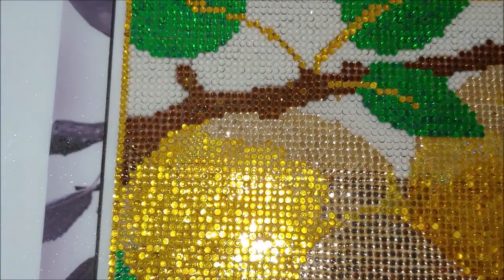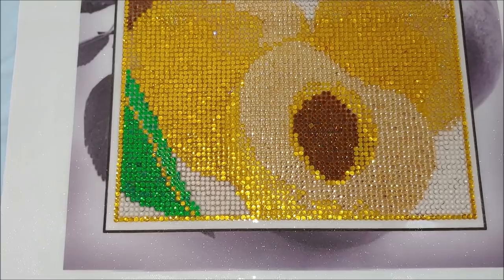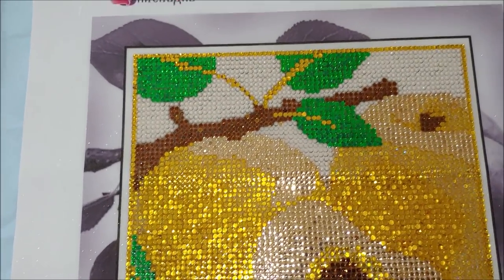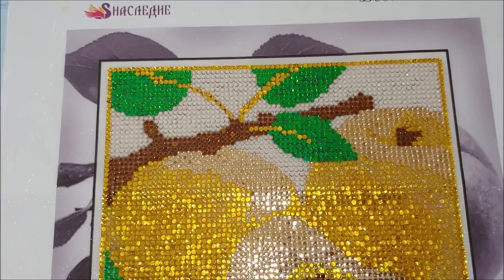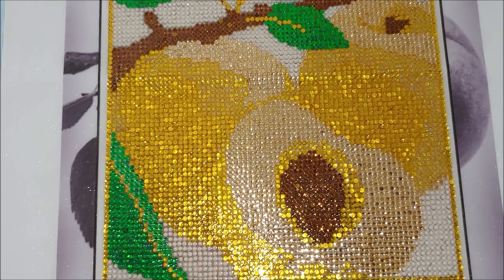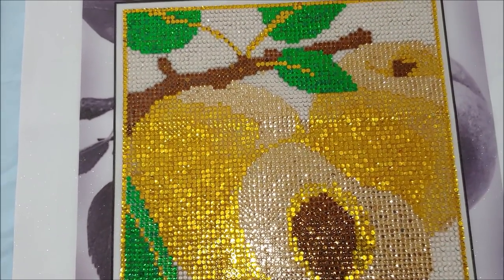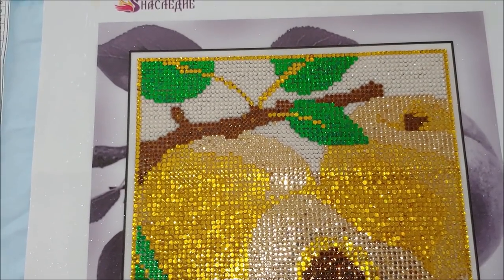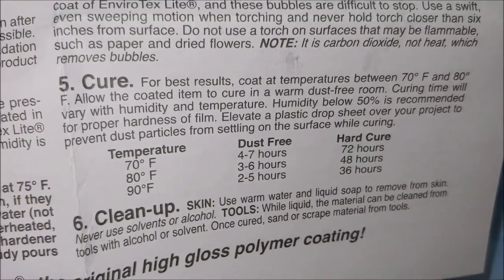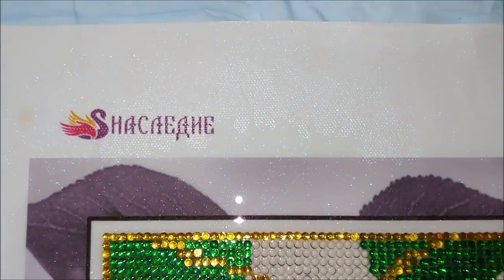The Clear Cast is now applied. To let it dry, store it in a dust-free room, and ideally cover the painting with a container to keep dust off. For a full hard cure at 70°F, you need to wait 72 hours. In my experience: 80°F takes about 48 hours, 90°F takes 36 hours. The warmer the room, the better.